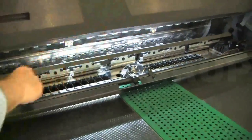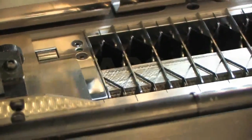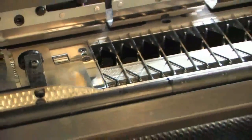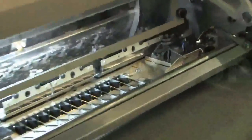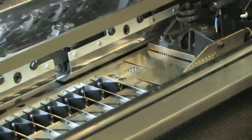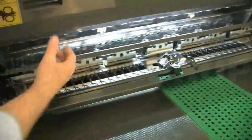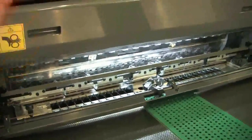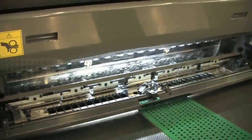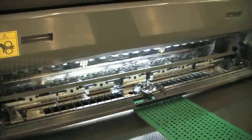At the front lay area, we have a vacuum side lay here, and we have a vacuum side lay at the drive side of the press. You can see these small vacuum wheels here. These are rotary timed vacuum wheels, and what they do is, as the sheet reaches the front lays, these vacuum wheels hold the sheet in contact with the front lays before the swing arm takes hold of the sheet and transfers it to the A transfer cylinder, the advanced cylinder.